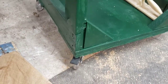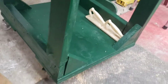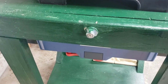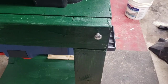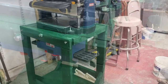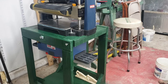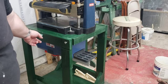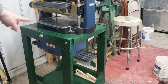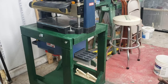The base is just a single piece of three-quarter inch plywood, and at the caster end there's an additional piece that supports the caster bases. The axle is a piece of half inch all-thread, and the flip stops are some five-sixteenths carriage bolts I had. For the most part, all the materials were spares already in my workshop — I did have to go to Home Depot for the all-thread and a piece of half inch PVC pipe sandwiched in here.